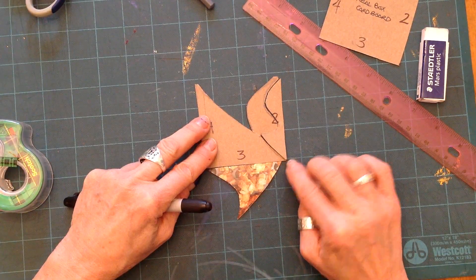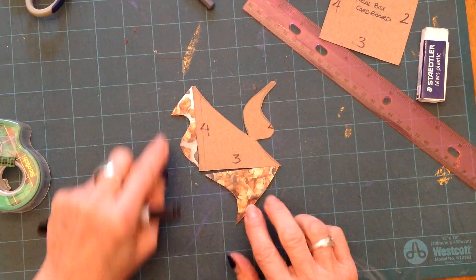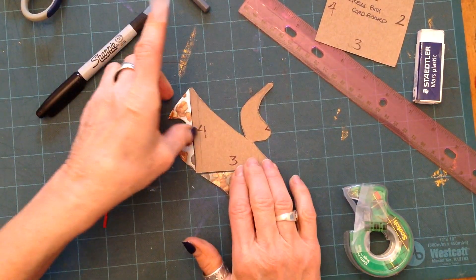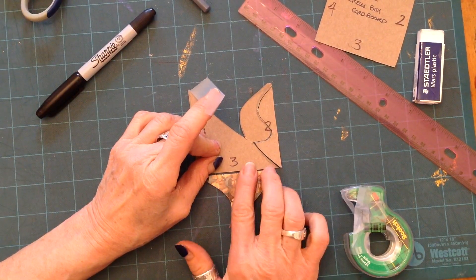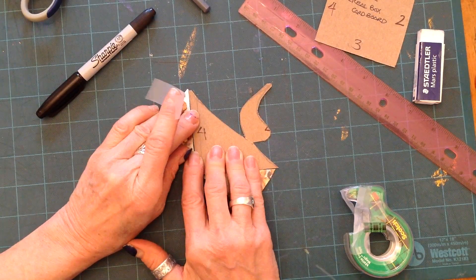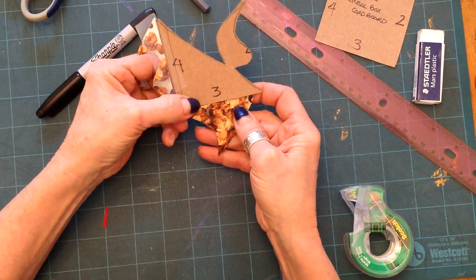And the same thing here — this one clearly goes right down to the bottom, so I slide it across and turn it, and because it was right at the bottom down here, that means it goes right to the top. And you can see it makes kind of a bird shape. So then I would tape it into place. The important thing is when you cut it out, it started right in the corner here, right at the bottom. So when I slide it and flip it, it now has to be right at the top here. If it's not lined up perfectly, it won't make a proper template. You can tape it on both sides so it's more solid, and you can see the use of having a two-sided cardboard now.